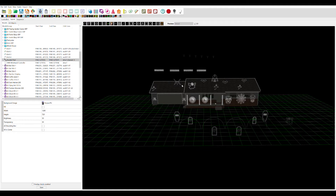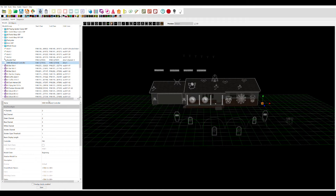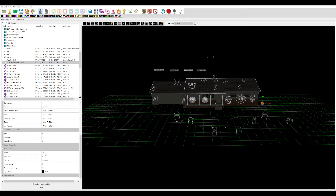We're going to do a quick setup video on the DMX wristband controller and the wristbands and how to get those to work in your display. You start by creating a DMX model — I did floodlight, it seems to work really well. Change the name to whatever you want. I like to label mine as 'controller' so I know it's the controller and not the wristbands. You're going to have two channels. I put mine on my F48.